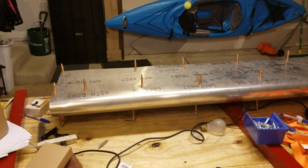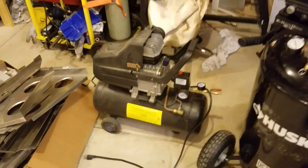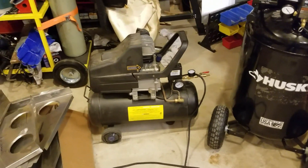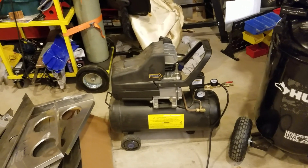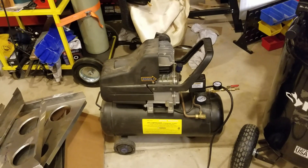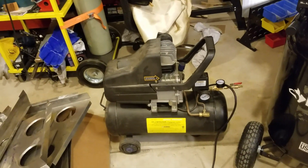I was drilling a little more constantly and the old Harbor Freight started to smell funny. At first I thought I was just reaching the thermal overload protection limit, but instead it actually tripped the GFI breaker and from that point on the unit will not even turn on at all. The motor won't turn, the pump doesn't turn when you apply power to it. It just trips the GFI as soon as you throw the switch and the machine itself doesn't make any noise.